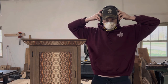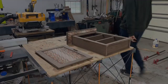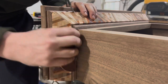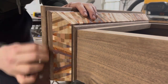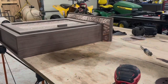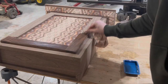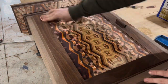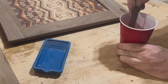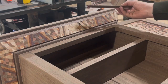With all the pieces and parts put together, you know what time it is — sanding montage! While you watch this, I guess this is when I'm supposed to ask you to like and subscribe, so if you want to do that, go ahead. I'm sanding at 30x speed here — if only I could sand that quickly in real life. Once I'm done sanding, I'm applying some mineral spirits to clean up all the loose dust particles and check for any glue spots. Then we can apply everyone's favorite finish: Rubio Monocoat.